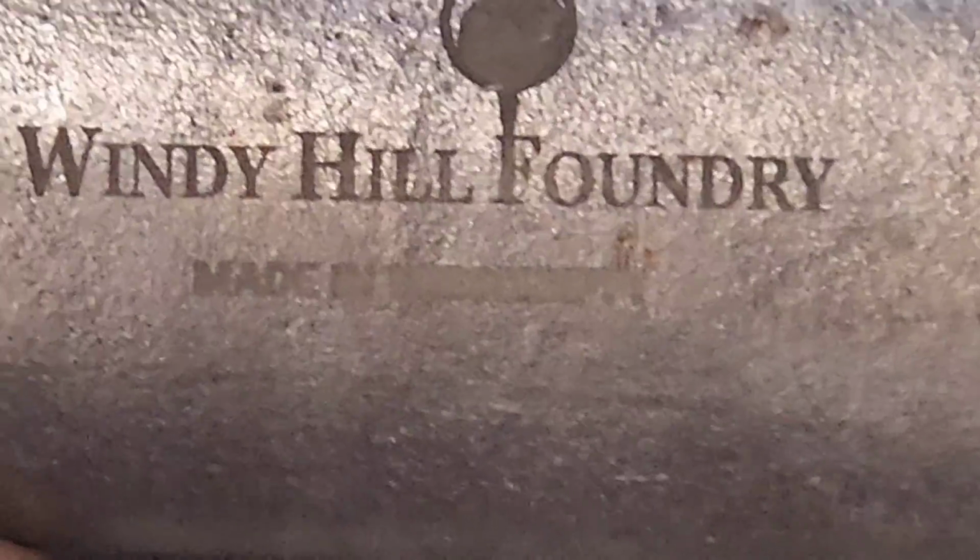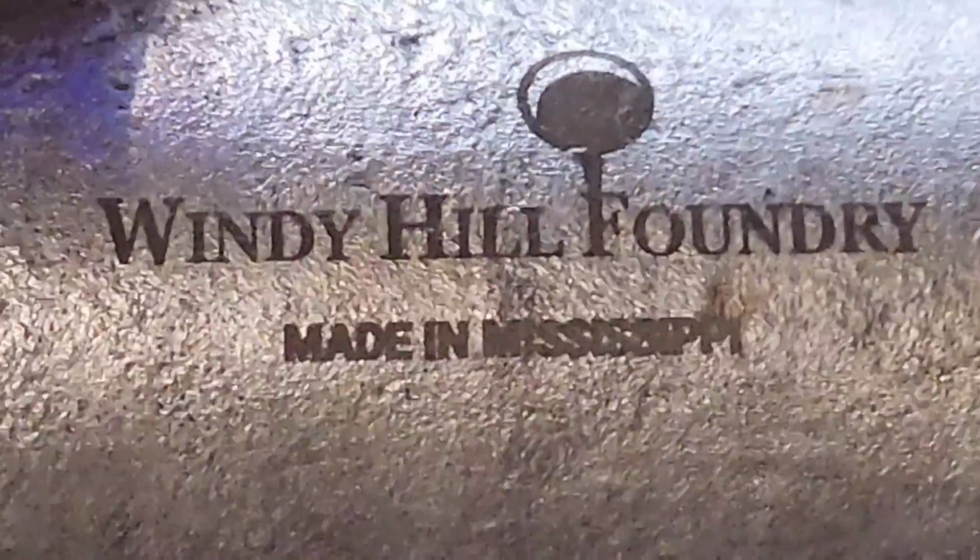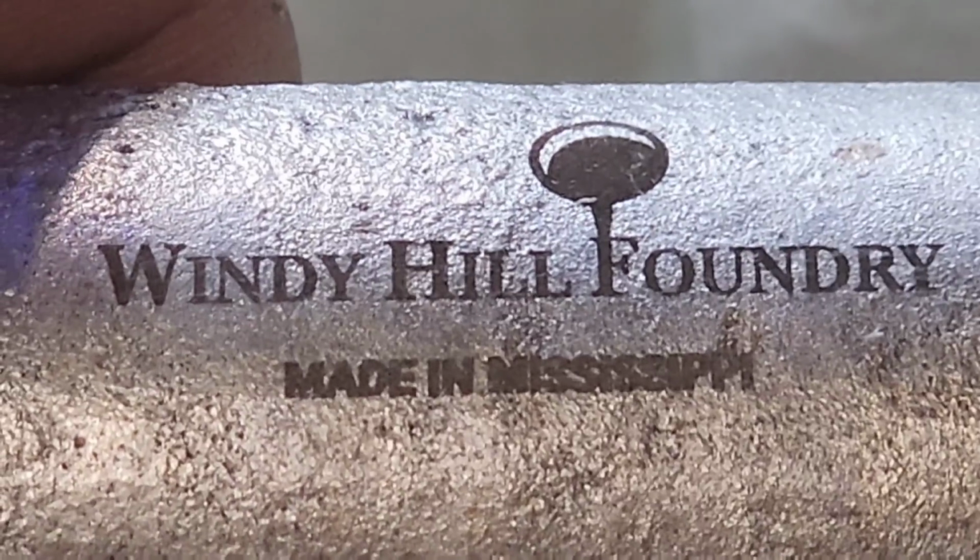The aluminum parts are the main ones that we need to be able to engrave on. So as long as it'll do that for me, I'm going to be very happy. Now, I'm not knocking it with a cast iron. We didn't have the settings right. Let me remind you, I cut the passes down from 10 to 3 on the cast iron. I didn't go a full 10 times. I was only at 50%. Maybe I should have tried that at 100.